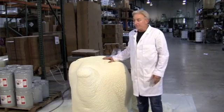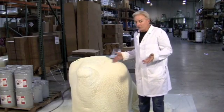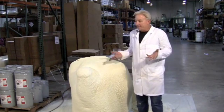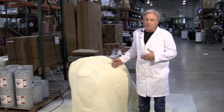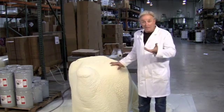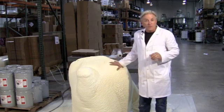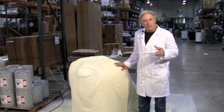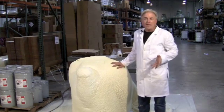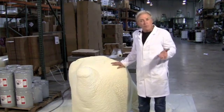Okay, we've completed the spray operation. We've sprayed about two gallons under the target, and we've actually increased the surface by three or four inches. In this case, we're going to modify a master for another mold that we're going to be doing. The demonstration is quite clear — the cartridge foam is superior in that it allows you to do small amounts of foam to a specific target without having to gear up with large, plural component equipment.